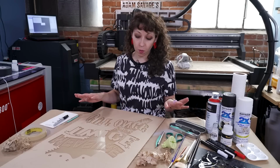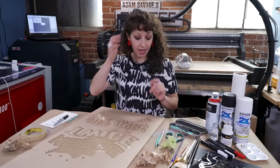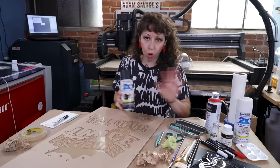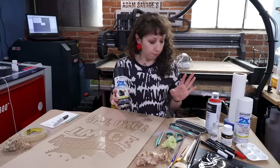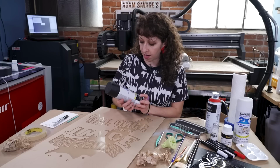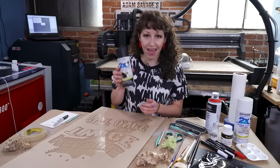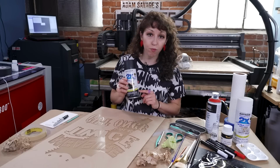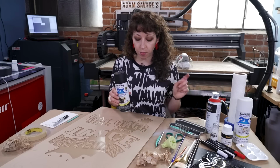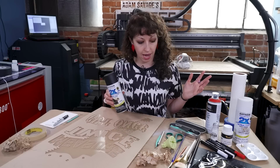So I'm going to prep my workspace and spray paint on that coat of paint. Before I mask up, I tried a whole bunch of different black color options on my sample pieces. I found that this Rust-Oleum Painter's Touch in the satin Canyon black color is a really rich, dark black. It's not the most opaque, you will need a couple of coats, but it is the richest black that I found of the black spray paint that I had on hand.